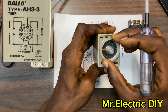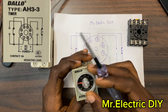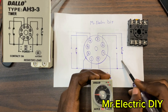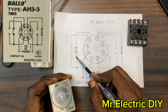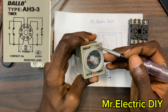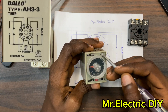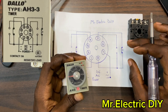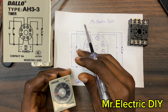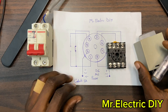You use this dial to regulate the on-delay time and the off-delay time, and that affects only the triangle side. The non-triangle side has its own way of working and is not affected by these time settings. When you turn on the breaker, the ON indicator lights up and counts down. When the preset time is reached, the ON indicator goes off, the APP indicator comes on, the closed terminal opens, and the open terminal closes. To use on-delay or off-delay timing, use the triangle section — not the non-triangle section.